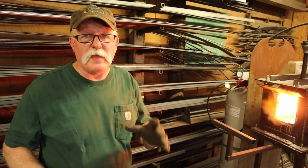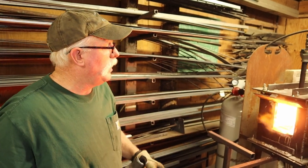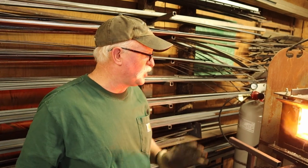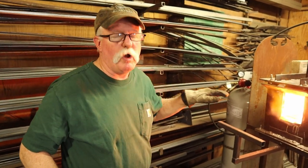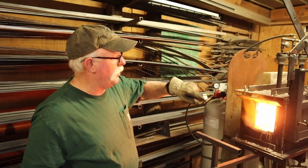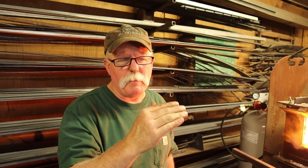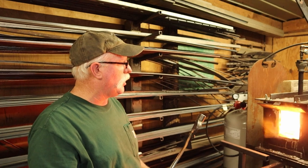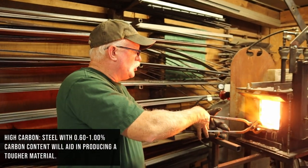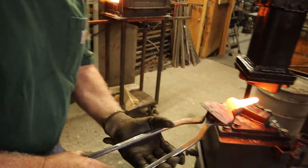Now I'm drawing out the pick. These things are called pickaroons or hookaroons depending on who you get them from, and like I said they're used to handle firewood. You can buy them to handle logs — those are a lot bigger. So right now I've got the cutting edge roughed in for the hatchet, and I'm forging out the pick. I'm kind of planning by ear and eyesight as I go. I want a certain amount of meat out there but not too thick, because you want to cram this into the end of a piece of firewood without it hanging up, but it's got to be tough enough to handle. I'll finish it by hand but we'll let the power hammer do the heavy work.